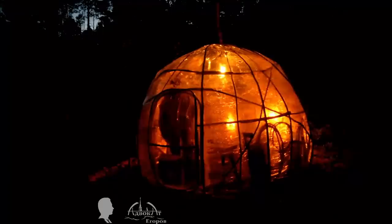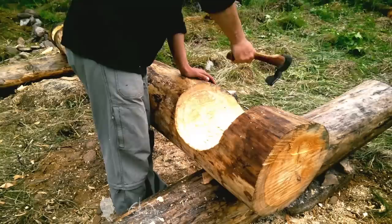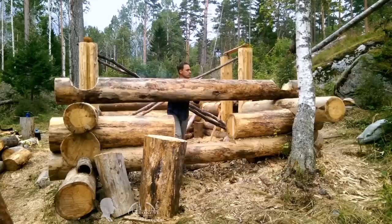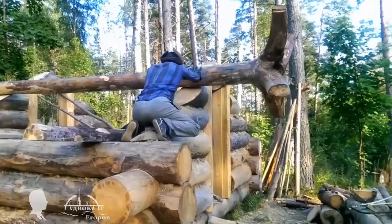I decided to build my cabin without chopping down a single live tree, using a round notch reinforced with a square peg, also known as a saddle cope. Many of the downed trees were huge, which is why my cabin was atypically built from extra thick logs. The roof was built from halved logs, with a polymer underlayment installed under the sod to protect the roof members from moisture and UV light.